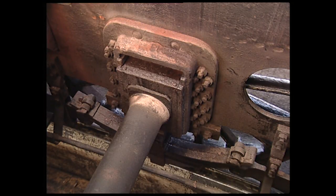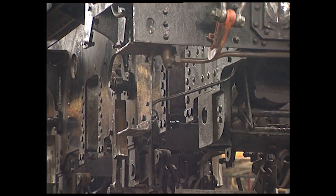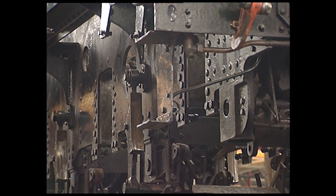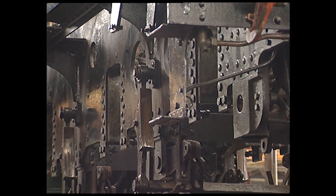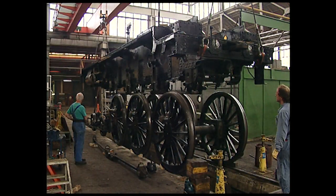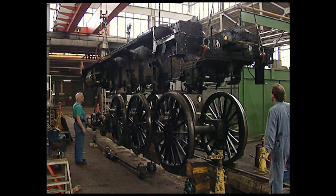This was insufficient on some locomotives, resulting in increased wear of bearings and even frame fractures. The horn gaps are strengthened by the horseshoe type axle box guides. Plate frames are often more than three foot high, which can frustrate maintenance.